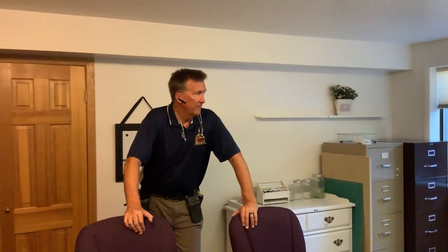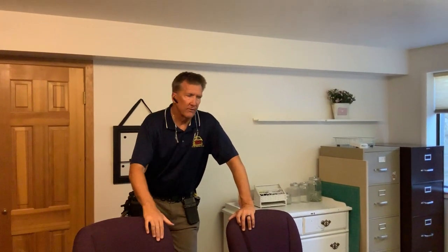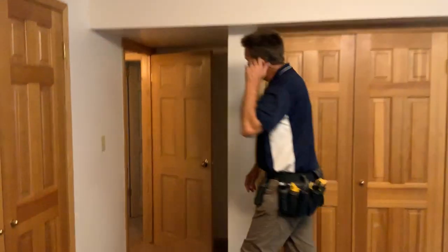There are no smoke detectors inside bedrooms because this home predates that. But by all means, come in and put the 10-year smoke detectors, and then every 10 years, change them out. Put a carbon monoxide detector in the hallways as well, on each level.